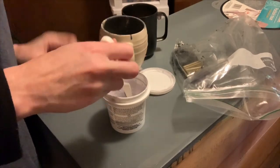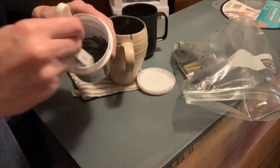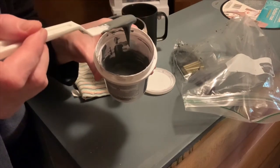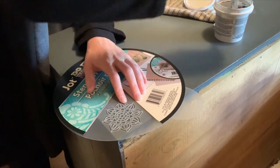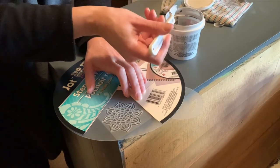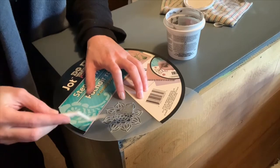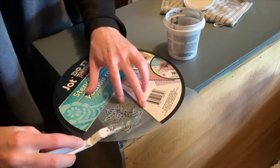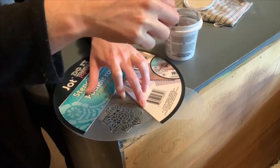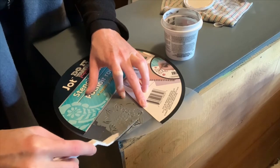You can see kind of a strip along the top of the dresser that I couldn't fill in with wood putty and I couldn't get it sanded down right. So I decided to add raised stenciling along the top to give it some added detail and also cover up that imperfection. I mixed up some more colored putty for this and it was obviously too runny and I tried it anyway — which wasn't the best decision. But the plus side is you get it on, realize you messed up, and wipe it off because it's that wet. I've already sealed it with poly so it's not like I'm ruining anything and I have to start over. It's just this one spot — I can fix it, which I do.